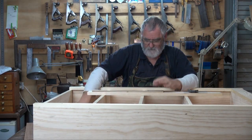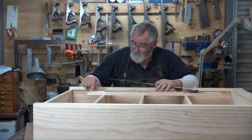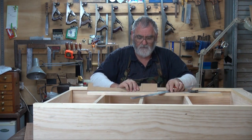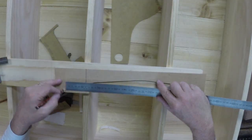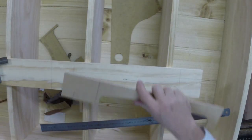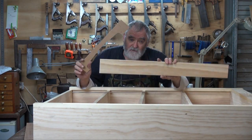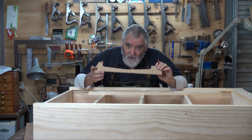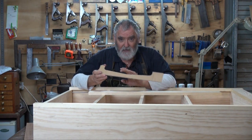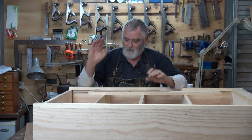What we've got to do is mark out — this is 70mm from the edge, so from this point here, mark back 70mm. We're going to dock that on the saw. Now it's a case of just drawing it onto the stretcher, cutting out the waste, applying double-sided tape, putting the template in place, and cutting it out using that profile cutter.